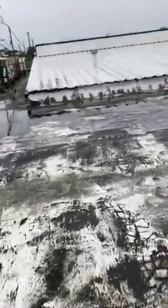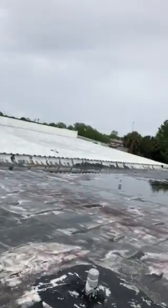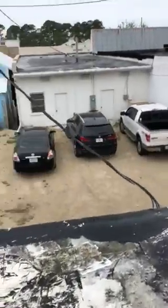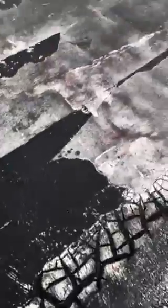What I would recommend is to cut these loose seams open and torch them back, then pressure wash it and put a pedigree acrylic coating over it with a primer that will adhere to it and protect it from further delamination.